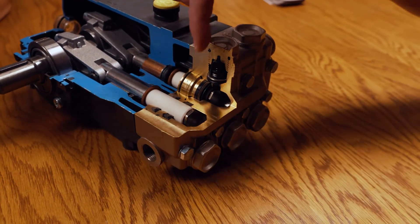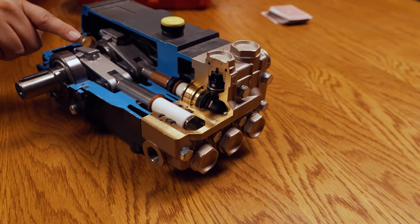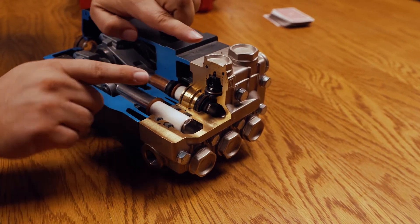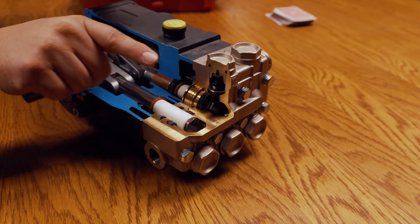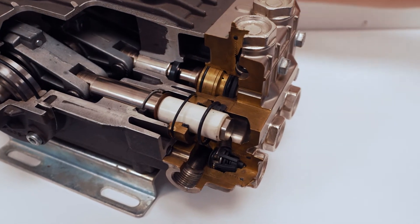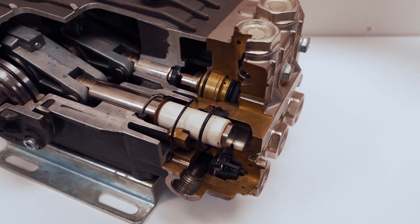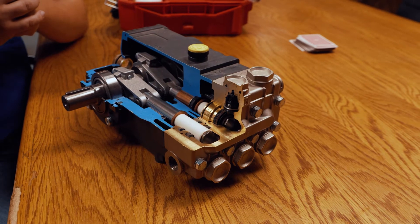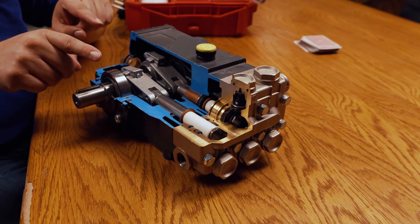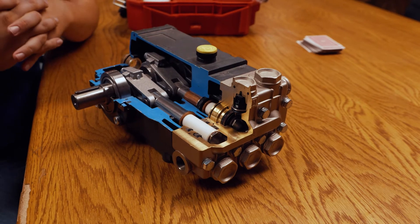I see here that these two are not lined up — why is that? Because one of them is pulling in water and one is pushing out. So this one looks like it's at the forward part of the stroke and this one's going to come back and forth — they work in this action. Then you put the third one in there and you get flow out of each one. It's not a perfectly smooth flow but you get a smoother flow as you have more cylinders. An old duplex pump, which you really don't see anymore, just had two plungers and those were more like chugga-chugga because they'd always hit-miss, hit-miss. That third cylinder gives you more smoothness in the triplex pump.